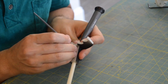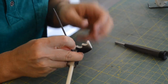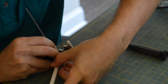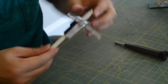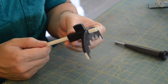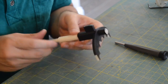While holding the ball in place, push the reversing lever axle up until it hits the tool holding the ball in place. Push the axle through as you remove the tool. Then rotate the axle so that the ball is pressed into one of the two divots in the axle. Slide the large spacer to the bottom of the reversing lever and the small spacer onto the top.